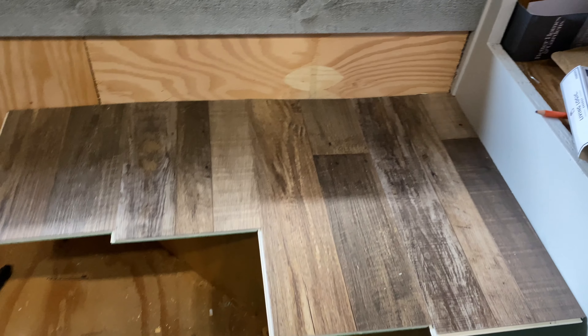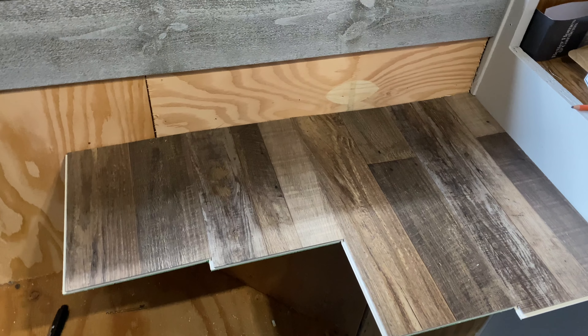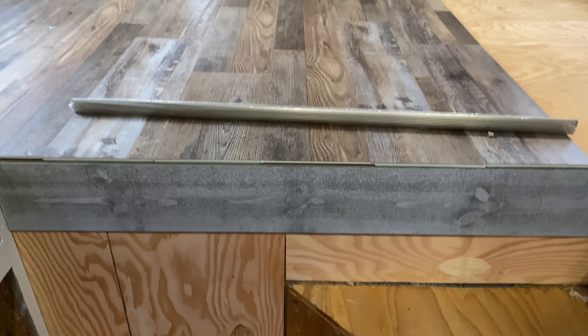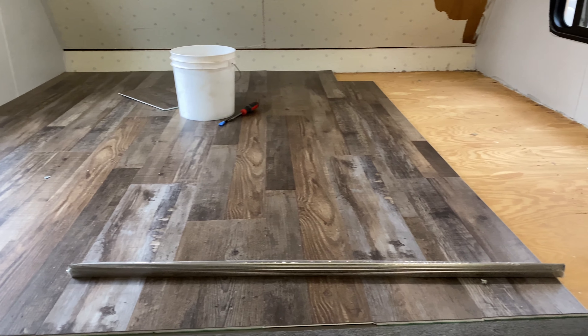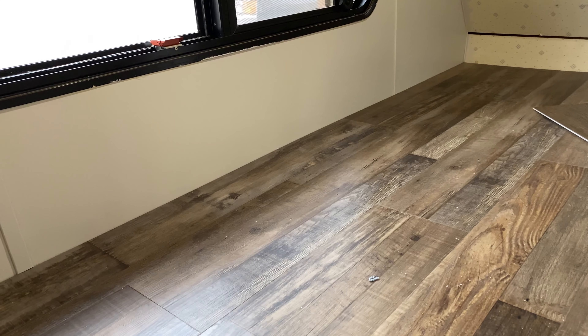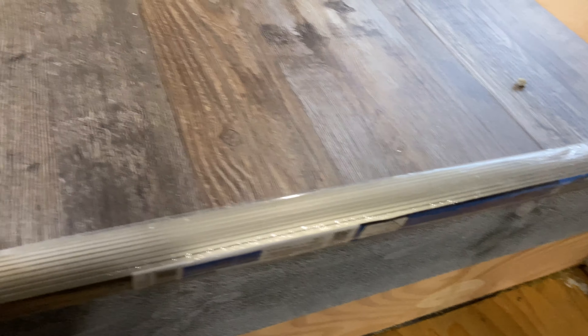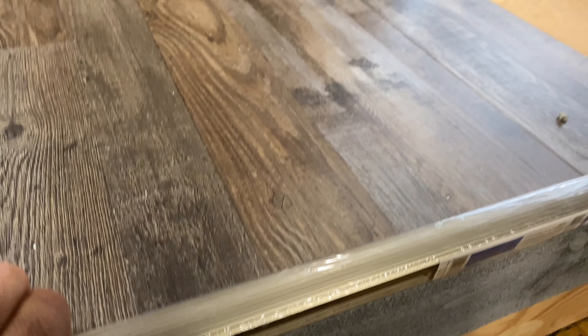I have to lay the flooring down on the top part and I have to scribe it. I'll put this on there and underneath I'll scribe it. Hopefully it's going to be a little tricky, but hopefully we can do that. We are moving on the flooring — I was worried about it not being square, but surprisingly to me, it is square. I don't think I'm going to need edging there, like a bullnose or a quarter round. But I will need one here — I busted the edge off, so I have to replace that. That'll look clean.